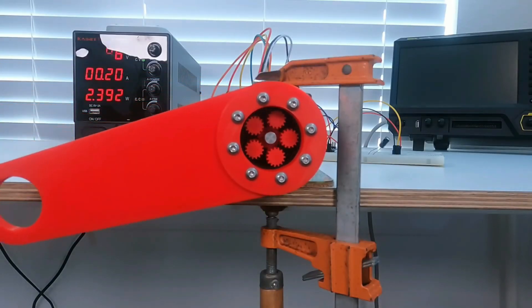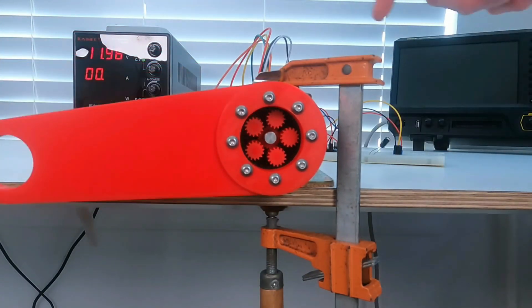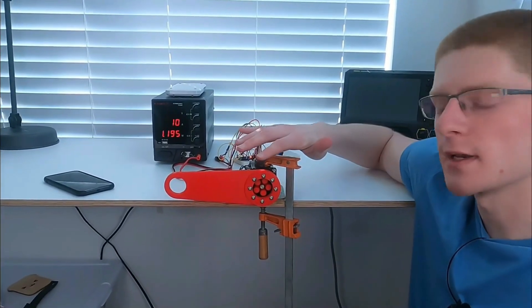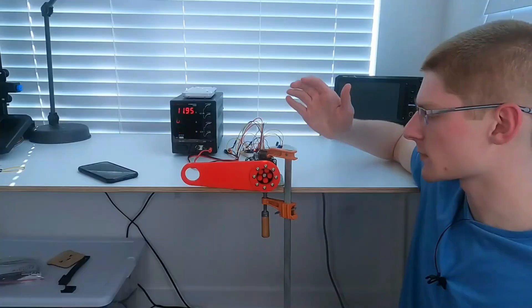That's my hypothesis, so the next step is to go ahead and test it. I've attached a 3D printed lever arm and I should be ready to do some torque tests. This actuator should theoretically handle torque significantly higher than anything I'd be able to apply to it, so I'm not expecting the motor to be the one to give up — if anything fails it should be the mechanism itself, the gear teeth shearing off. My goal is to test to complete failure. The actuator is holding a stall torque right now. There is a little bit of backlash we can see, but it's not too much and I think I could get rid of it.